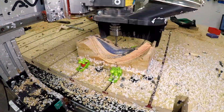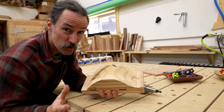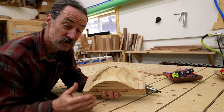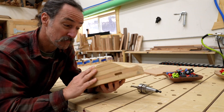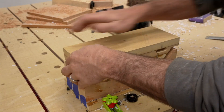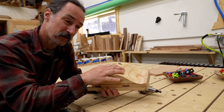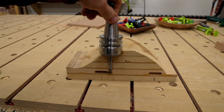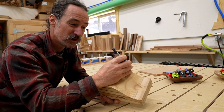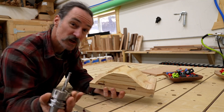I could then go ahead and do the finishing operation with a quarter-inch ball nose and it finished totally fine. Given this curved shape, I needed to figure out how to securely hold it and machine the other side for a two-sided operation. What I came up with was a jig made out of MDF — several layers glued together — just the negative shape of the top side of the petal leaf, using double-sided tape to hold it. Always run simulations: I didn't on this one after changing some toolpaths, and during the finishing pass my bit dived down and totally stalled my spindle, which nicked my jig. But this actually worked out to my advantage, as I'll show you in a little bit.